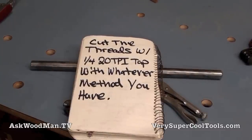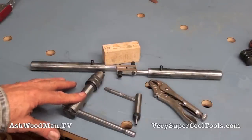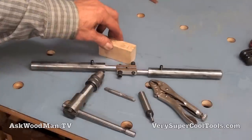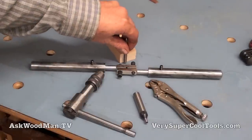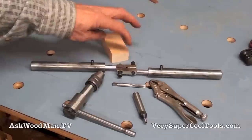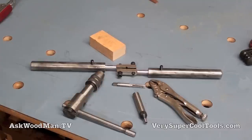Now you're ready to cut the threads in the drilled-out holes in the tubing. Use whatever method you have — a ratcheting tap drive, a tap wrench, a spring-loaded tap center on the drill press, or even just a pair of vice grips. I like to use a block to help keep everything nice and aligned and square. Some people like to drill a hole through that and tap through it; I prefer to guide by sight, moving the block around the location. That allows for easier chip clearance and getting cutting fluid down in there. I fortunately have a hand tapper, so that's how I'm going to do mine. Let's go outside to my metalworking area and hand tap them.